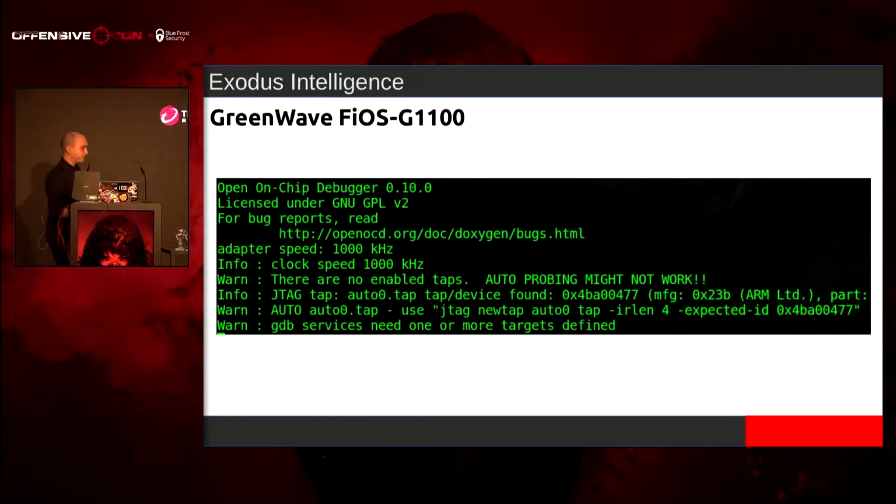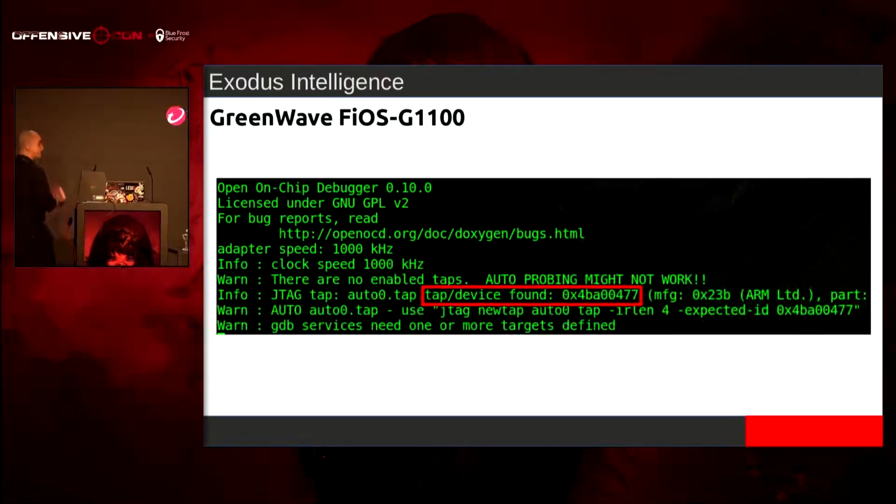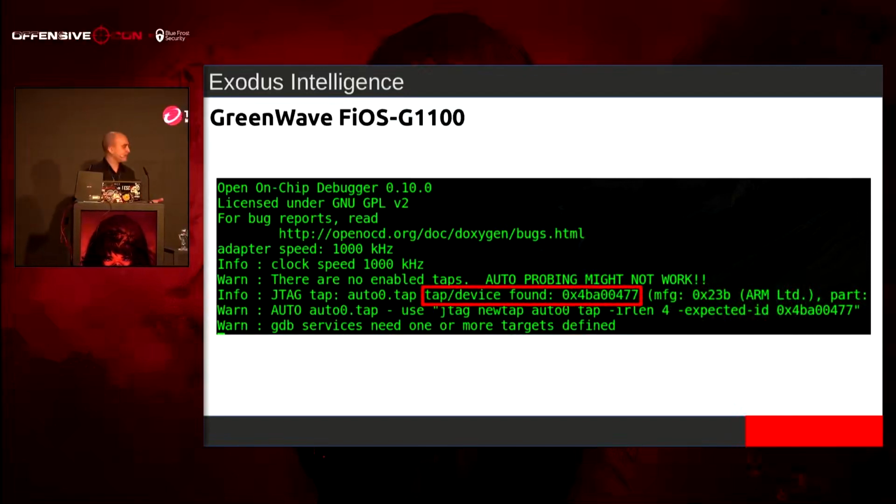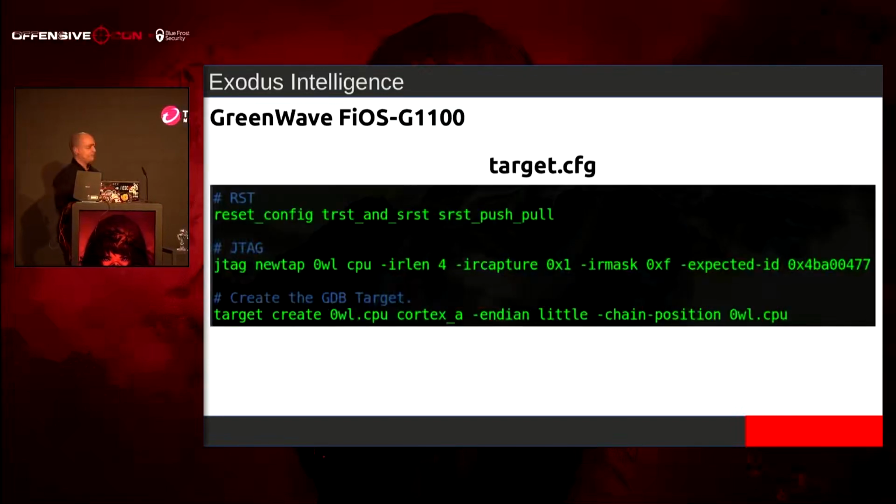We have our interface card, which is an FTDI FT2232H. It's a two-port 232. And so we get the ID from it. So we do have a JTAG interface. That particular ID, I couldn't find inside the target directory of OpenOCD. There wasn't any pre-configured configuration for it. So I looked at the manual and figured out what everything is. And it was pretty simple.